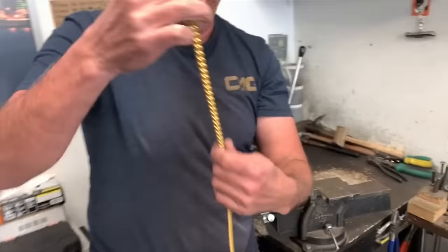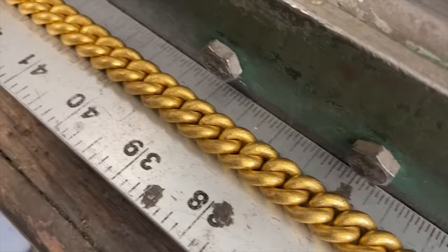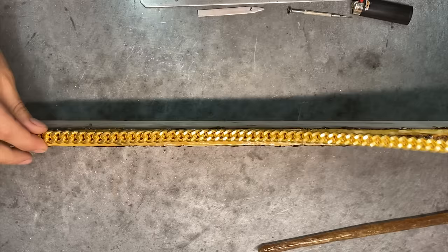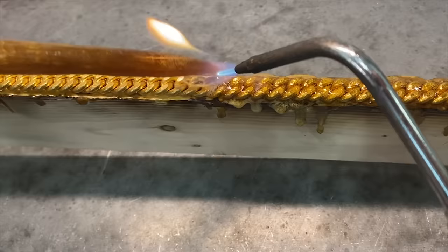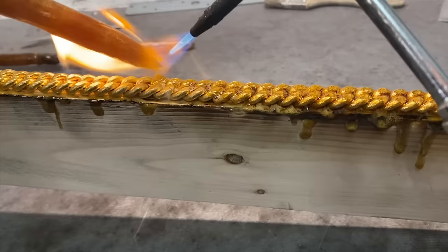Because they're ready for fight. And now that it's finished twisting, we're gonna glue it onto the stick to file. So, like, basically carve it into the curb shape. And then we use shellac to glue it onto the stick. So you have to glue the chain to the stick to be able to put on the vise. And that's how it gives the curvy Cuban link shape.